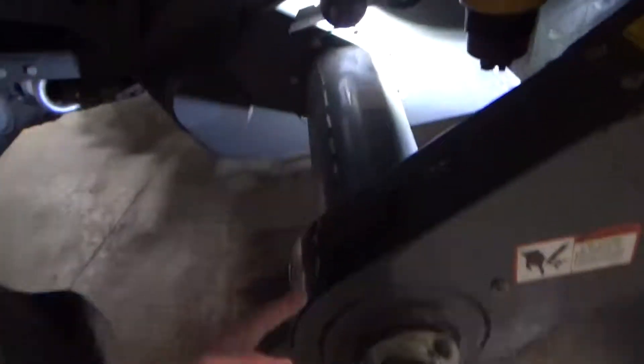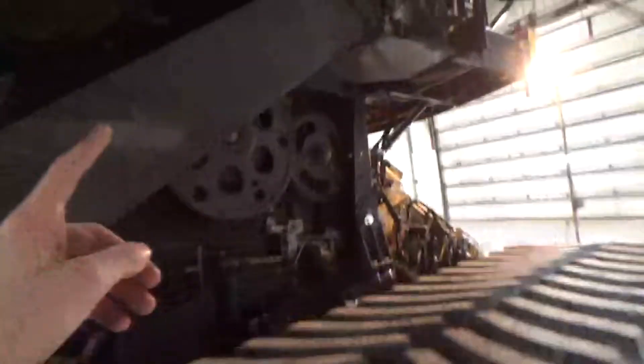And then this is our tailings — anything that doesn't go through the bottom sieve will come through this auger, go up through that, go through in the air, and you see those two things right there — it'll drop it right back down by the APS drum and the threshing drum. They'll all go back through the machine. The tailings elevator right here is pretty much just a mini clean grain elevator.